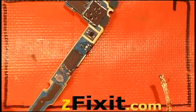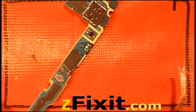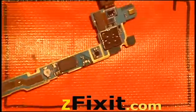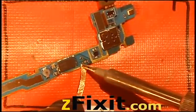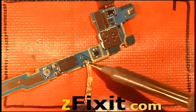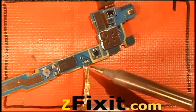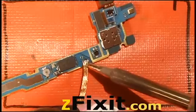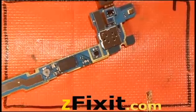We have low melt solder on both sides now. Get the desoldering braid — make sure you cut off the old used portion and you have fresh wire. Still at 340 degrees Celsius. Just be careful not to leave the iron too long on the board. It's wicked up pretty much all of the old solder from the through-hole anchor points.